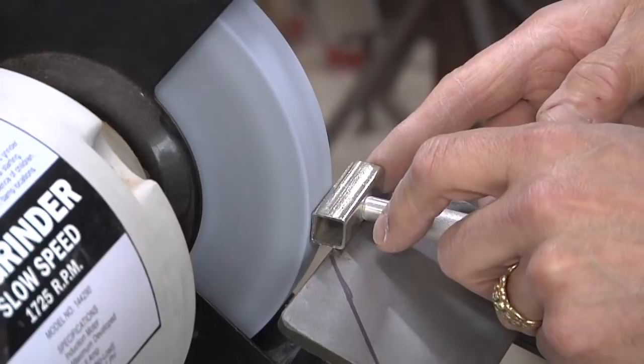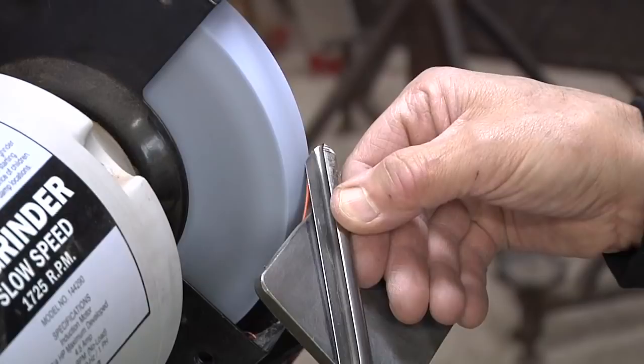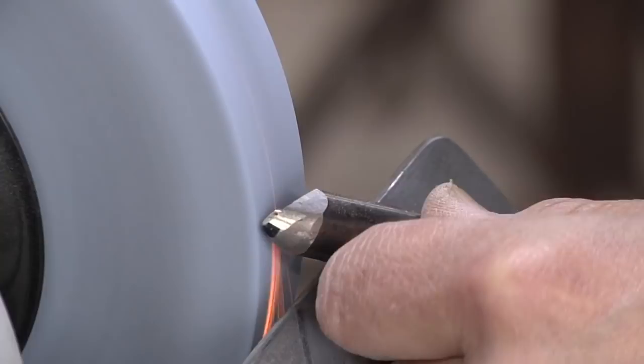Sharpening begins with using a diamond wheel dresser to flatten the 80-grit wheel. I like using a felt-tip black marker to draw some lines on the bevel — that way you know exactly what metal you've removed when you start to sharpen. I recommend using Stu Batty's platform sharpening technique: draw lines on the platform at 40 degrees using a protractor, then set the angle of the platform to grind a 40-degree angle on the bevel or nose of the gouge, and grind the wings straight and round the nose.